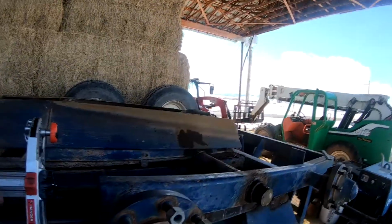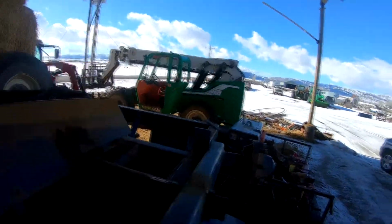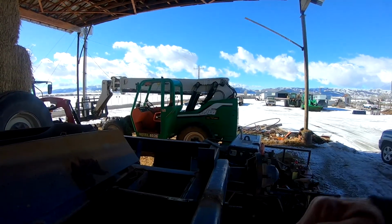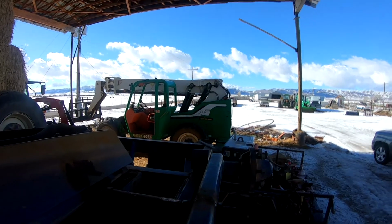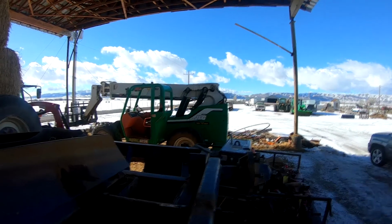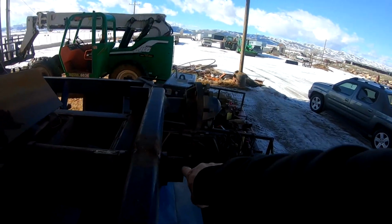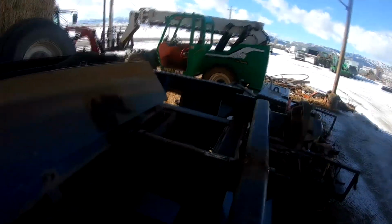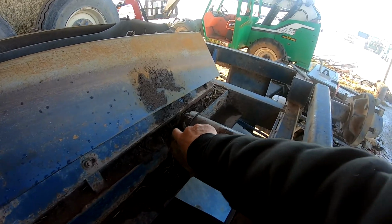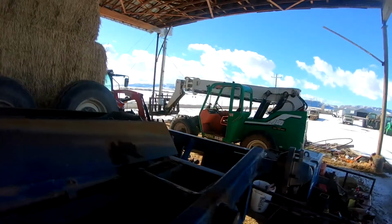I had to put this together to find the right spot for this beam. Then I had to get it level with the proper camber. When we get our end plate welded on here, then there's a collar. This collar here will be welded to the axle to hold it in there.